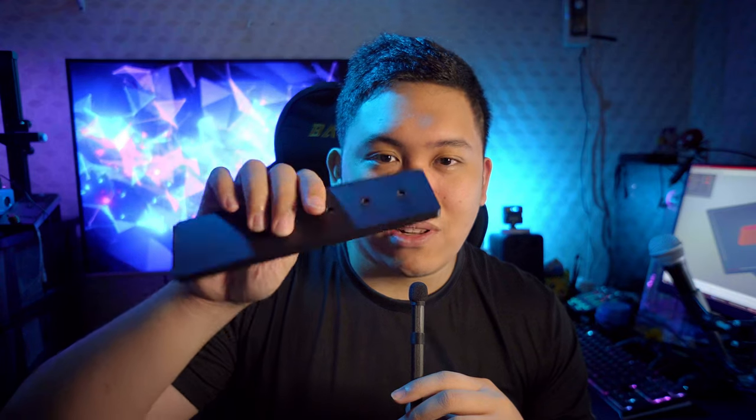But this printed on the bed, laying down like this. I should have printed it upright so that I could have the strength of the individual print lines going across into where that lip was. So there's a lip here. There's a lip right here, right?